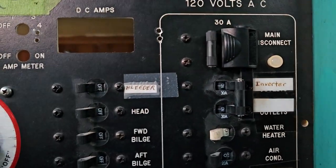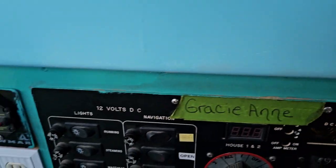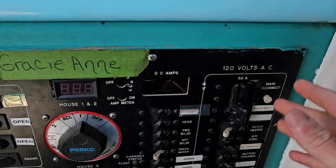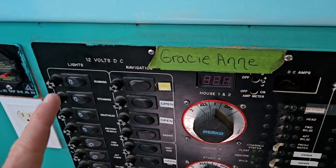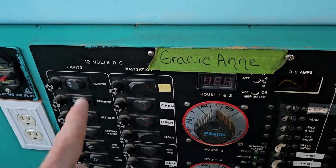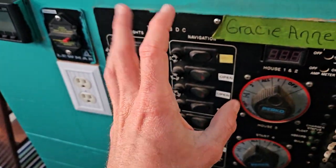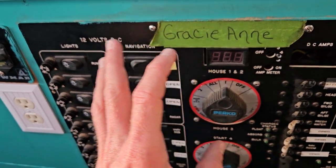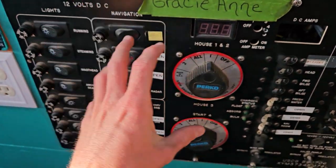But anyway, on a boat, typically what you do is you have both AC and you have DC power systems. Now, unlike a house where everything is always AC and then your electronics will convert it over to DC and then actually technically back to AC, on a boat, you can actually run both because your batteries are going to be on a 12-volt direct current, typically 12, sometimes 24. So anyway, that was a big thing, redoing all of the electronics.